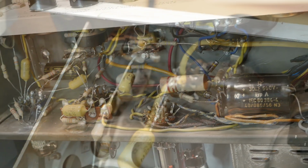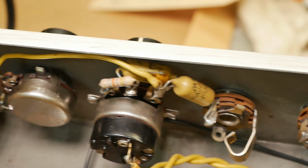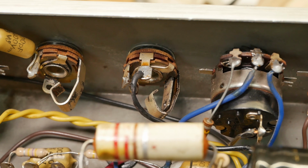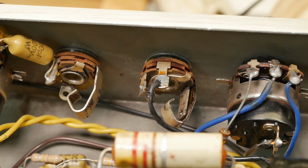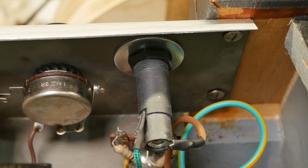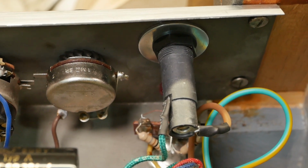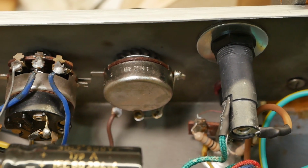Which is what this is going to be used for, so happy days. In addition to that, we also put some lock washers on all the jacks there, removed them. They just had aluminium washers before, which offer some sort of springiness, I guess, being a soft metal, but they don't bite in like an actual star washer. So now we've got them on all the jacks as well as the pots, which it had as it came in. Had to put a washer there for the fuse holder because the main selector switch had about a 14 mil or 15, 16 mil hole. So that, I think, ended up being a 14 or 13 mil, probably half inch. Probably should have measured it before I started talking on video, huh?